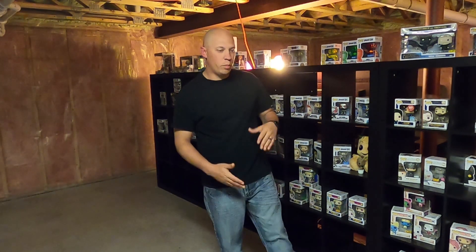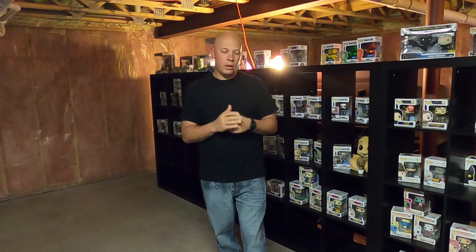A couple of things we learned while trying to print this out: the sides where the ball bearings slip on — that needs to be increased. I would reprint those at probably 100% infill, which I know might be a waste of filament, but it's going to make those sturdier connections. I ended up breaking off three of the four posts, so once it's on there, if I go to remove it, it's probably gone again. I would print the pillars or the rollers separately. I tried to print it all at once and it worked until my bed went unlevel. If you print them separately, try to center them on the bed, just like with any other print.